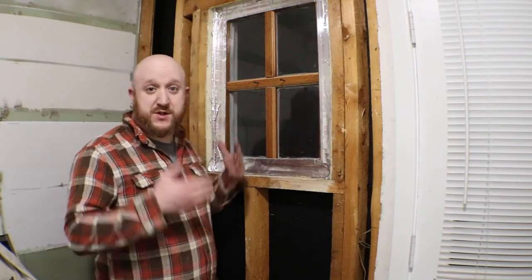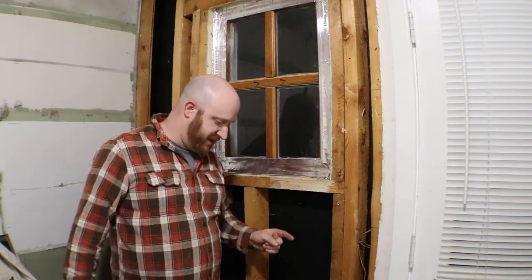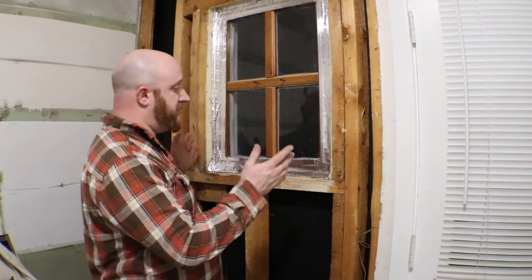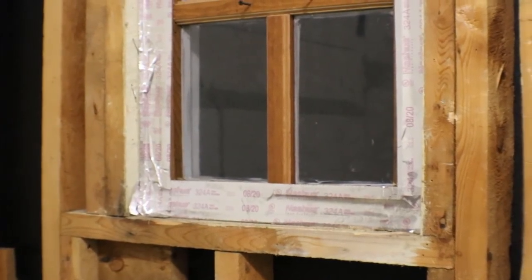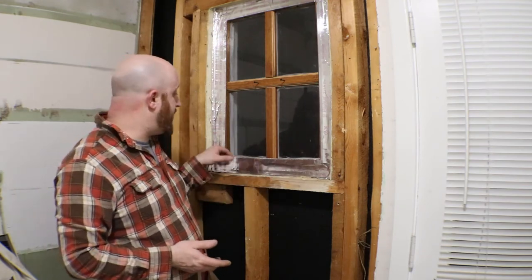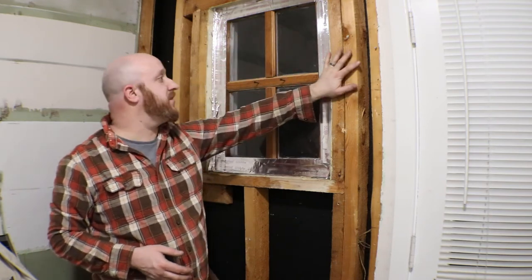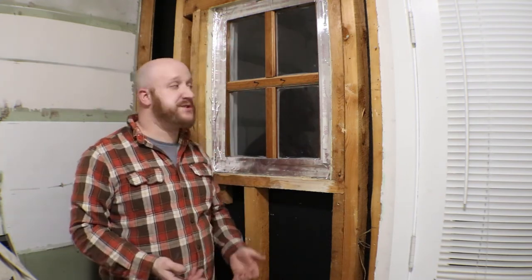It's finally gotten dark outside, so now you can actually see what I'm working on. After discussing with my wife, we decided to put an outlet at the bottom and try to put it as close to the door as we could, so that when we open up the dryer door, if we have something plugged in there, it won't get hit. For temporary purposes I used some silver tape from my job to seal up where we had some air leakage, because it's getting cold in here. I permanently put these screws in the window, so when I go to box it in and cover it up, I'm literally just going to cover it up. I might have to scab a board in here to give me something to put the drywall screws to.